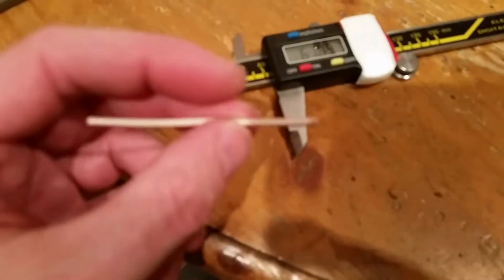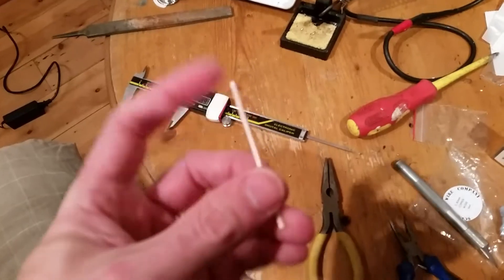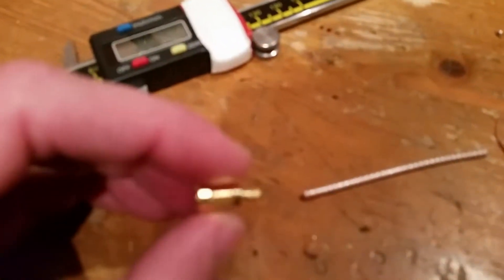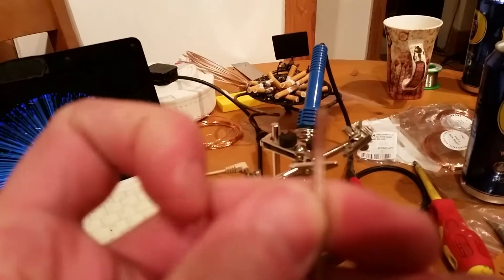Take a little over 60mm of coax — it will allow for errors and 60mm is just over a wavelength, which helps keep the thing out of the Fresnel zone. Take the coax connection — this bit's a bit of a pig, these connectors are a pig and I've screwed up more than one, but they're about a quid each max. Measure up to about there, skin the coax carefully — just roll the coax gently under the knife, then bend it back and forwards and you'll find a break. Coax exposed — offer it up.